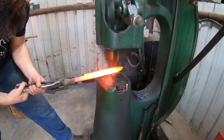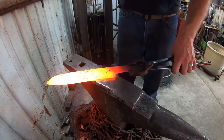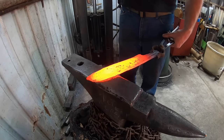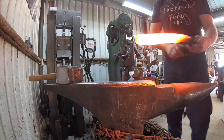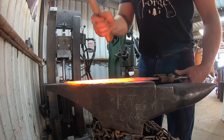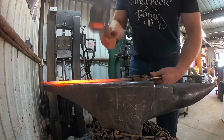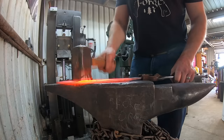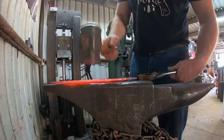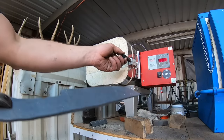Getting some of those channels formed in the blade by the round dies, forging those out and flattening things up, I begin working on the bevel. I want to forge this bevel down to an appropriate thickness primarily because I want our san mai cladding to follow all the way down very close to the edge of the blade, instead of revealing about halfway up — which is what would happen if we left the thickness consistent across the width. Some final forming, forging, and straightening — this blade is starting to take a nice shape, almost like a Hudson Bay camp knife of the trapping era, those large wide blades trappers used for various camp chores.